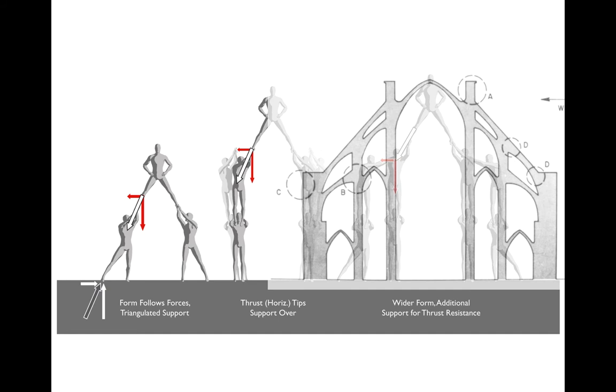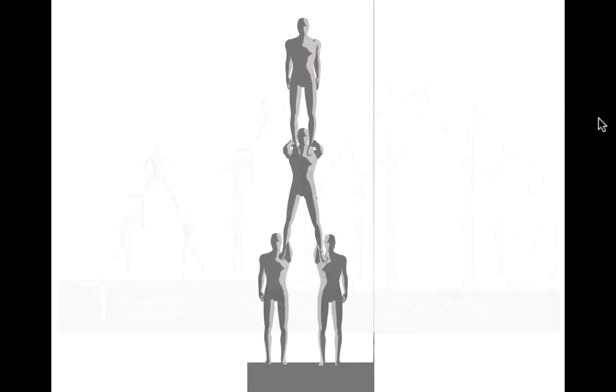And this is very much the kind of section or the kind of structural idea that you see in Gothic cathedrals, right? The builders then, even though they didn't have the math that we have, knew intuitively that to carry the loads of, in this case, stone vaults over a fairly broad space, the weight of those stone vaults would certainly get turned into a vertical component, but that as soon as you are taking those loads at an angle, you'll also get a horizontal component. And you need something, in this case, stone flying buttresses that are leaning in and taking the horizontal component of those loads.